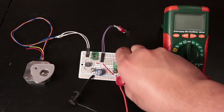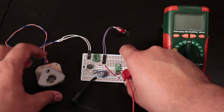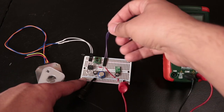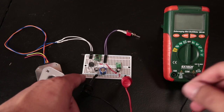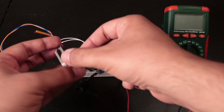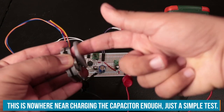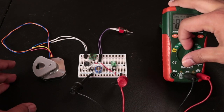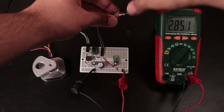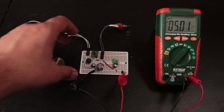Here you can see the soldered circuit. I've got the stepper motor connected to the rectifier, going through just how I documented in the schematic. I've got a removable toggle switch for easier assembly, and my multimeter hooked up. Let me spin this up real quick — give it a few good revolutions. All right, let me turn that to volts DC, flip the switch, and hey — five volts! That's what we want.